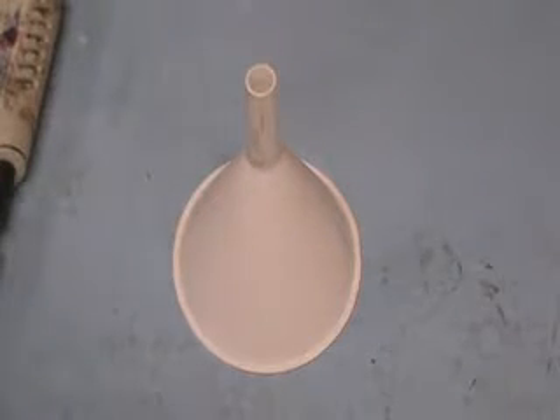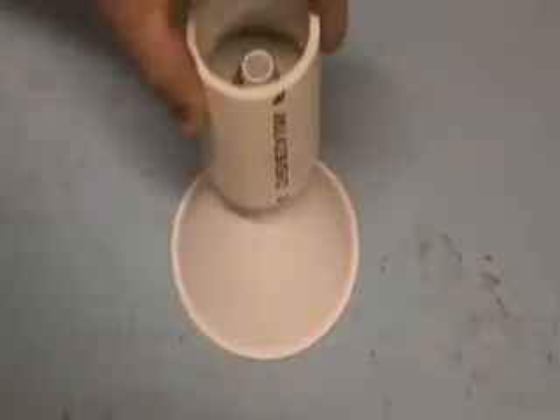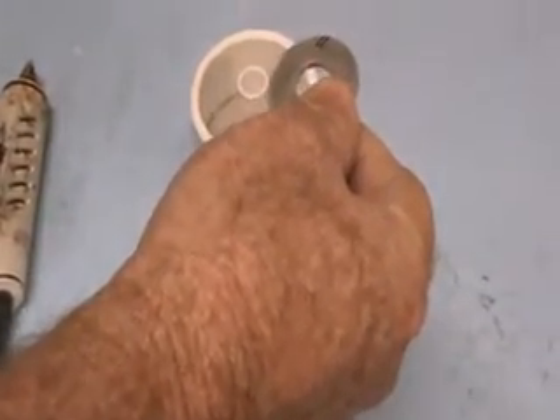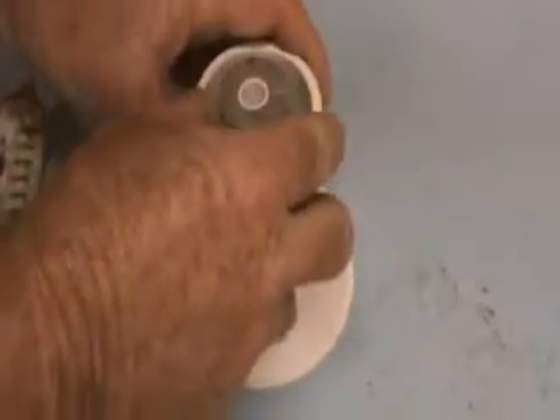It's probably the same as any other small funnel. It has about a 60 degree total angle, so a 30 degree half angle. I think that's about right for a converging cone. So I take a two and a half inch piece of two inch PVC, place it on the funnel, and I place a one half inch USS flat washer on the funnel as a centering aid.